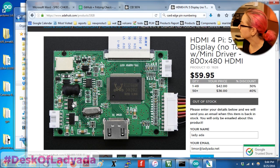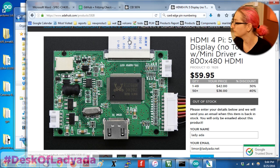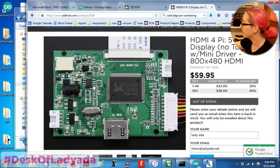Over here, you can see there's clearly a linear voltage regulator. It's a 3.3 and a 1.8 volt. You've got this crystal here, and the crystal even has the value on it. Lovely. You can tell it needs the 22 picofarad and a 1 megaohm resistor to stabilize it. A couple of simple passives. And then you can see here, this is the LED driver. The LED backlights for all these displays are usually 7 to 8 LED strings. You need a constant current boost converter, and that's what you've got here.